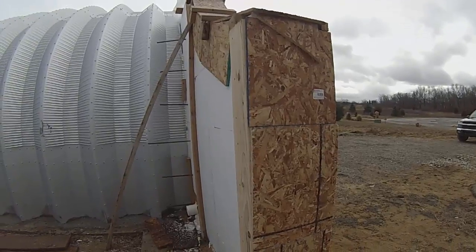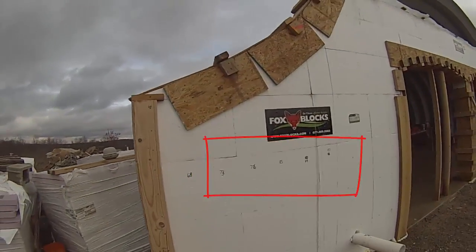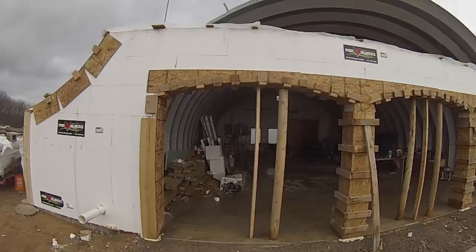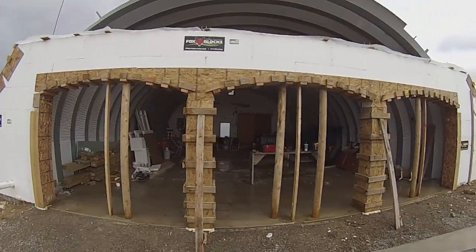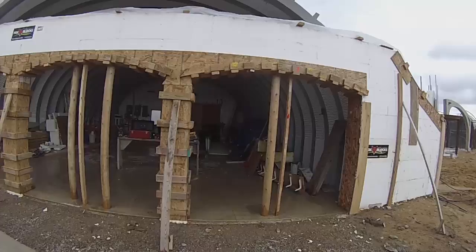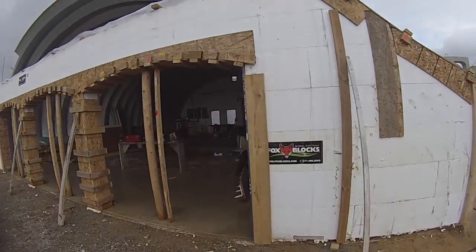Here's a video tour. You can see the minor bracing that we needed on the back side of this wall and the particle board end caps. Those numbers along the bottom are coordinates used for trimming the curve. There are no attachment points on the ends of these Fox Blocks, so the loads all need to be transferred and distributed through these side boards and into the furring strips embedded in the front and back of each Fox Block. The plastic at the top is used to keep the rain out of my freshly poured concrete. All the blocks and boards are temporary, but probably critical.